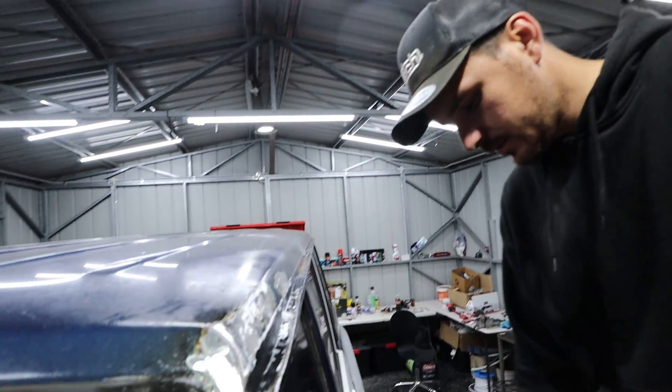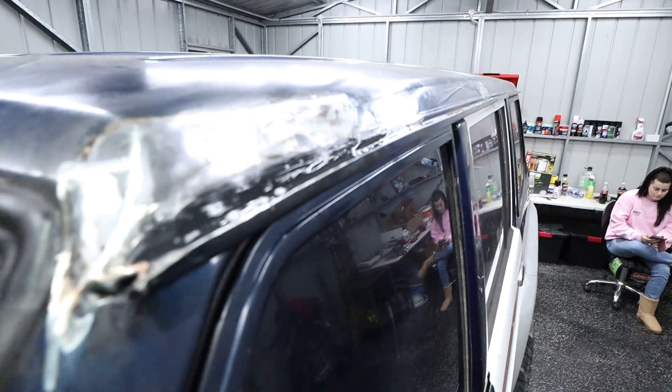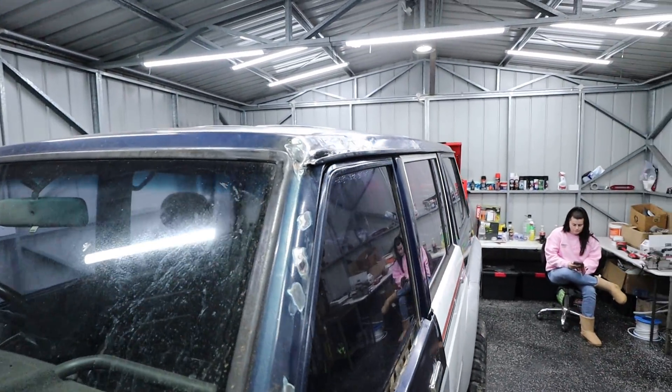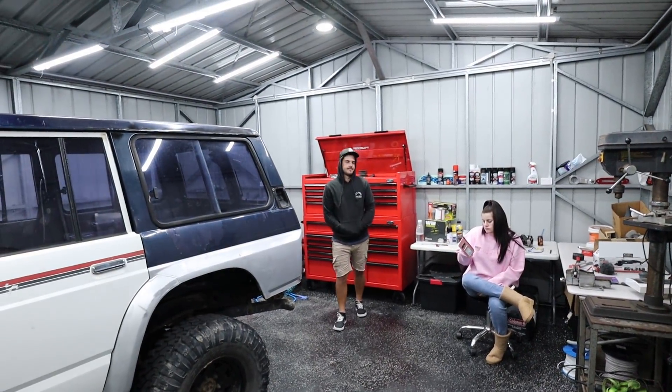See, if you're not a good welder, you can just fill it with Sikaflex — that's the game, mate. Alright, bloody hell, what a massive day. Probably went quick for you guys, but it's been long for me, Harry and Jessica, and we are finally done. Sikaflex Pro up in the gaps on all the welds — didn't do the whole seam because we didn't really need to. That's just going to help any little crevices that are pitted or anything like that, just seal them off. But all in all, I think we've done pretty good for a weekend's work. We've obviously cut out all the rust, plated it, it's ready for bog, primer, and then paint, and then we're going to sand the whole car down and wrap to spray it. It's going to be a really new colour that nobody's ever seen before. So get keen for that.